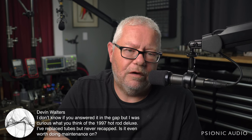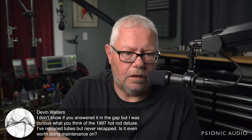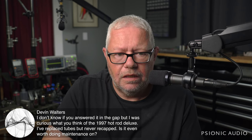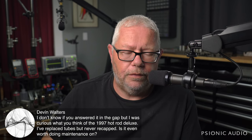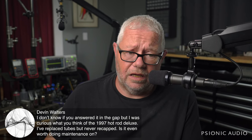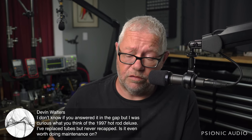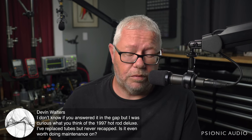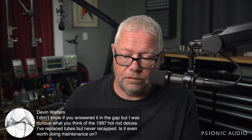Devin, I hate to tell you, it doesn't matter if it's 1997. Any Hot Rod Deluxe is at best a ticking time bomb, if not already damaged beyond reasonable hope of recovery. But sometimes we get lucky. If you've not recapped it, odds are you already have some pretty big heat damage in the area of the 5-watt resistors and Zener diodes. And odds are one or more of your 22 microfarad filter caps are either leaking or on the verge of it. You probably also have the beginnings of some broken solder joints on input jacks and volume pots and tone pots.